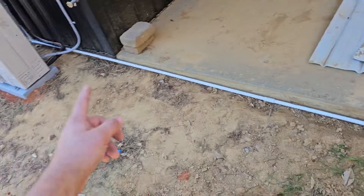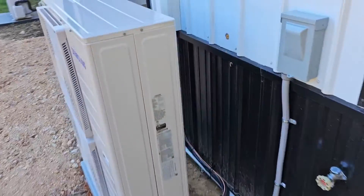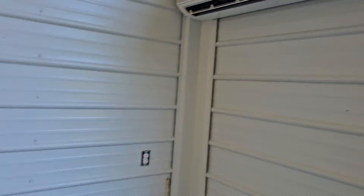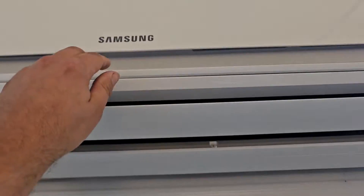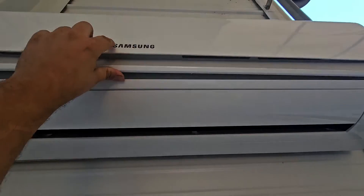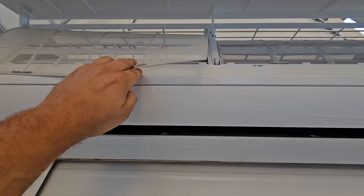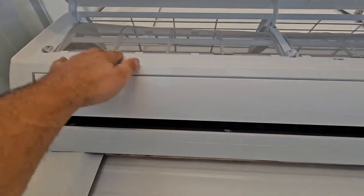Maintenance for this type of equipment is super simple. If you ever have water pouring down your wall from that indoor air handler, you just suck out the drain with a shop vac. The other maintenance task is cleaning the filters. I'm going to turn this unit off so you can see the filters. You can lift this up, prop it, and you've got your filter right here — just pull it out, wash it, or blow it out with an air compressor. That's the way you want to clean it.